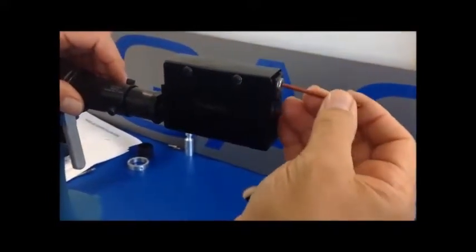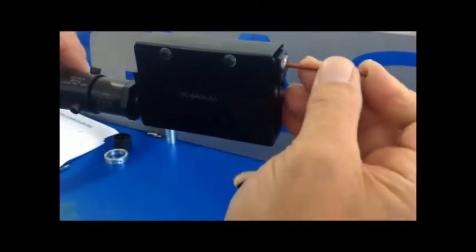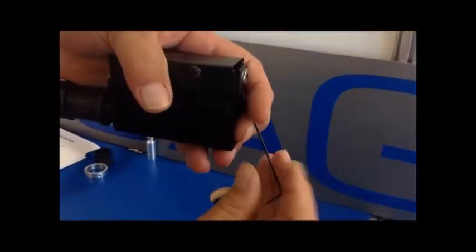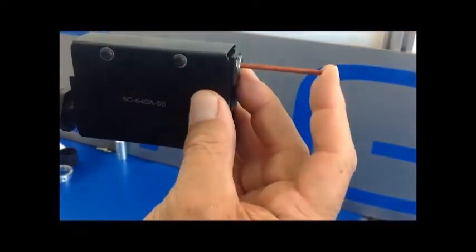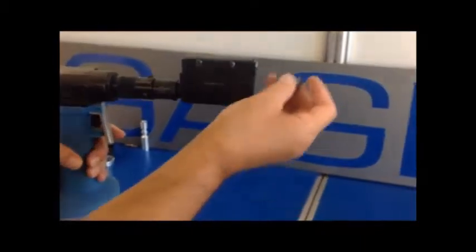Right now we are threading the anvil in clockwise so that eventually our gauge will stick out around ten thousandths outside of the inner anvil. Right now it looks to be around flush, so we may want to thread it in one more turn — maybe a half a turn — and lock it down. We will check that gauge one more time. As you see, it slightly sticks out the front of your nose tip. Now we are going to install another rivet to see if it breaks within specification.